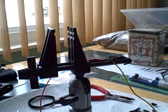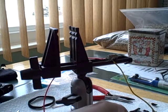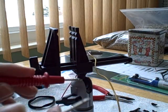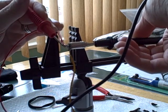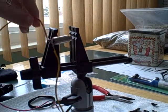Let me hook that up real quick. The cool part is there are three different sections for a headphone cable — the right and left channel and then the microphone. We'll do the continuity test. For the barrel, you put it inside. That squeaky sound means we have continuity. I tested all these connections and they all worked fine.